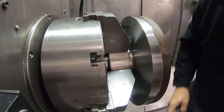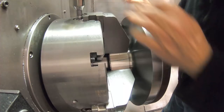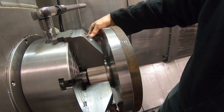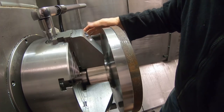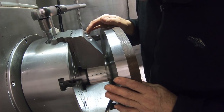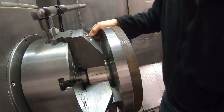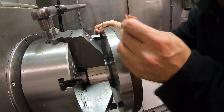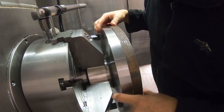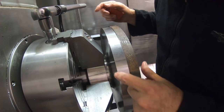I'm going to snug it up a little bit here. You may have noticed these tie-down pieces I have. They're not to support the part for machining - with the flange sticking way out here, just chucking on the shaft supports itself good enough to machine. But it'll ring like a bell, so I found I could snug these up with some rubber behind here, just hand tight, to keep it from ringing, as well as put a couple of magnets on here too, just for the finish cut on this bigger flange face.